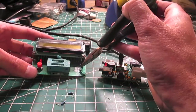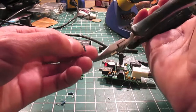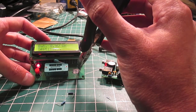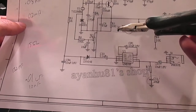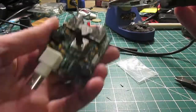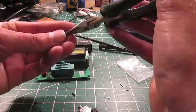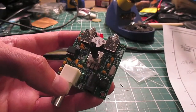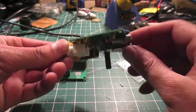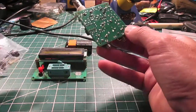The last one should be 47 nanofarads — that's the only capacitor left, and it measures 32, which is close enough given the tester's inaccuracy. That goes in C9. I also haven't put the electrolytics in yet. Now measuring resistors — that's 10k, so my 10k resistor goes in position R5. And that one is definitely 1k, so by the schematic R3 takes the 1k resistor. That covers most of the small passives in the kit.